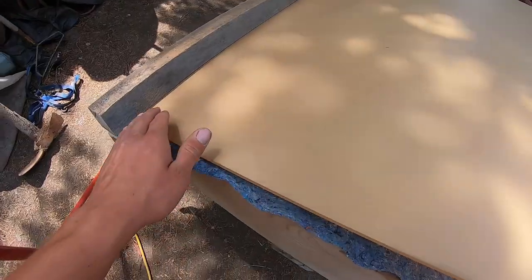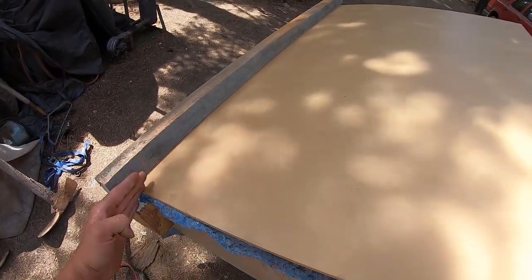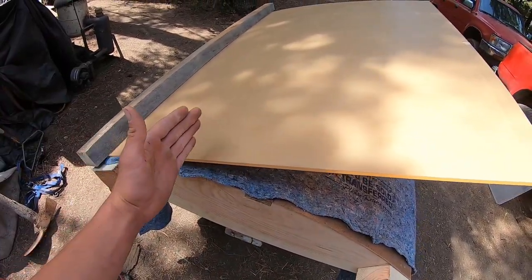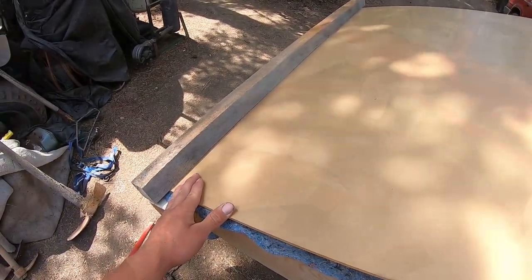So now, I'm gonna slowly, very slowly, apply heat along here until it bends a little bit on its own weight, move up a very small amount. And we want a high definition bend. We want a gradual curve, not individual chunk, chunk, chunk, chunk. So we're going to be working our way across very, very slowly, and this is definitely going to require some patience.